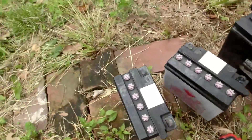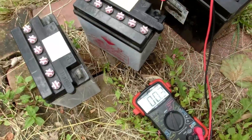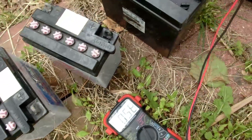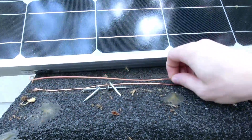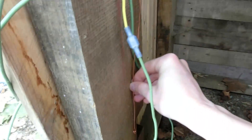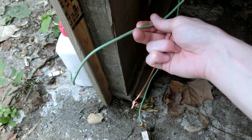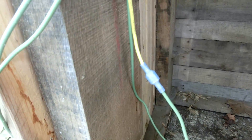These ones I just took off the charger — they've been charging for about a day and a half and they're doing pretty good. Before I put all my batteries back in here, I'm going to slightly upgrade the system. I'm going to add these two wires which will act like little bus bars. I'll nail them right here — one will be positive and one will be negative — so instead of having jumpers daisy-chaining from one battery to the next, where if the first connector didn't connect then all the others wouldn't get power, each battery will be connecting directly to this bus bar.